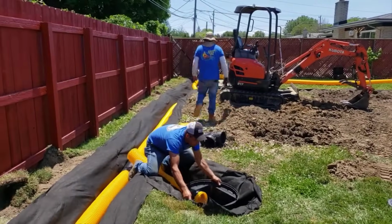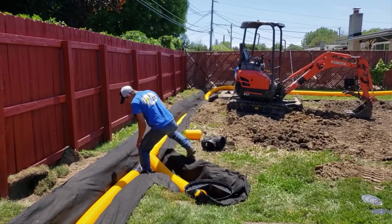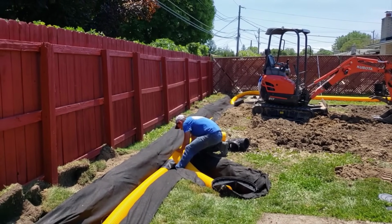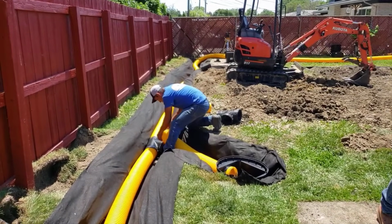So I put a drain right here next to that cement pad, the outdoor living space. Now, you see how deep that is? See how we really have it recessed compared to the grass around it? That's because I want the water to go in that basin. I want it to catch everything. So that's going to be the low point at this point in the backyard.